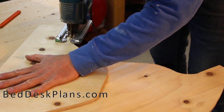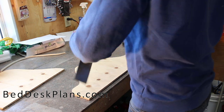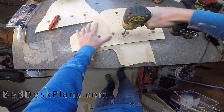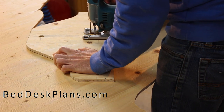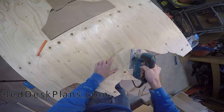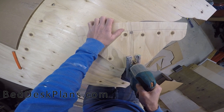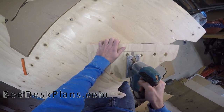The good thing about using this plywood for the template is that if I make a mistake, a new sheet is much less expensive than the finished-grade plywood. I made a couple of small changes, which was easy to do at this stage. I laid out where the slide hole goes for the bolt as the bed raises and lowers, drilled two holes one above the other in the right spot following the plans, then cut the slot with a jigsaw. On the prototype I used a router, but I'm finding the jigsaw a little easier and more user-friendly.